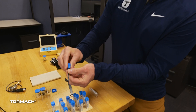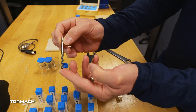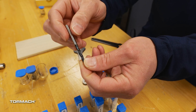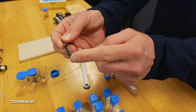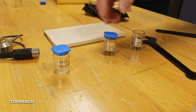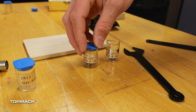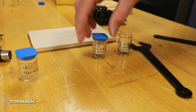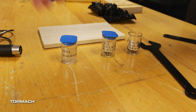So to start off with, let's talk about the first part of the actual tooling itself. This is a 4mm end mill — it's got both a 4mm shank and 4mm diameter cutting tool. The shank is the part that goes into our collet. The XS Tech comes with three different collet sizes: a 1/4, a 1/8, and a 4mm. All of the tooling in your XS Tech kit comes with 4mm shanks.